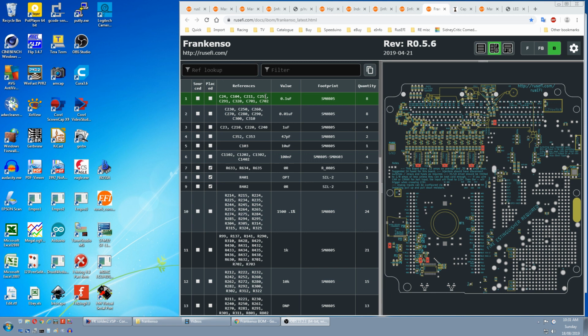Now it's a matter of going through the iBOM part groups one by one in order. Select the group, slide out sideways, find the part you want to fit, reference it to something nearby. In this case it's the bottom of the IC. Most are easy to reference. Like this one is the closest one to the bottom row of these through holes. This is the one on the left under the SD card holder.